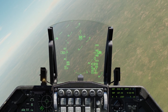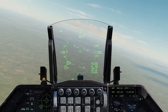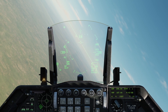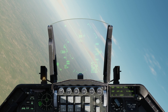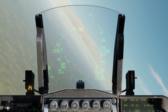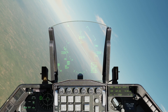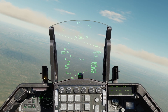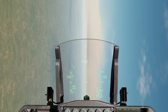The way to use trim — nose up or nose down — it's pretty sensitive, so I tend to just hold the stick if I'm making a turn, because typically you're not turning all that much. But if you wanted to, you could bump the nose trim up a couple of times, and now with my hand off the stick it's got 1.7 G and I've got a pretty level turn going here. I typically don't use it for turns, I just hold it, but that is one thing you can do.